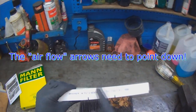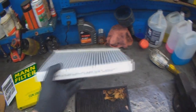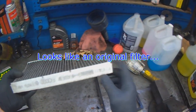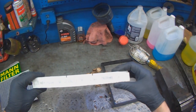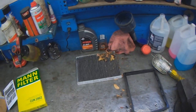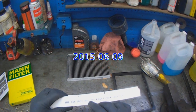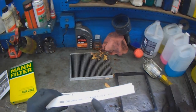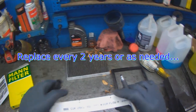There are arrows here, so you want to place the filter in the car with the air going down — the blower motor sits here. This one is actually quite old looking. Obviously it's doing its job, but you can see it still looks like an Audi. Sometimes you can see a manufacture date — I don't see one here, and that's why I usually label mine. Oh, there is a date: 15-06-09, so 2015. I always like to mark it. You should replace it every two years.